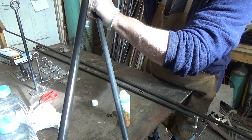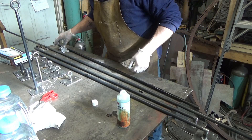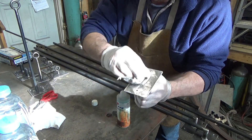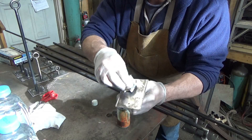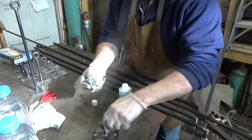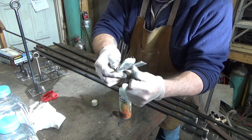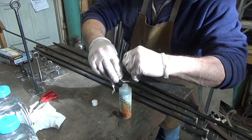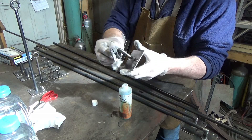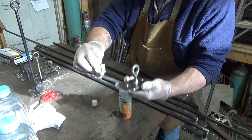That's the one we just did — it's going to work well. This stuff goes a long way, that's the nice thing about it. Here's a piece of relatively clean steel. Just by wiping it on, it's going to get darker. They say let it sit for 60 seconds. Hopefully we can get some even darkness between the rod and these shiny pieces that I just cleaned up and welded.